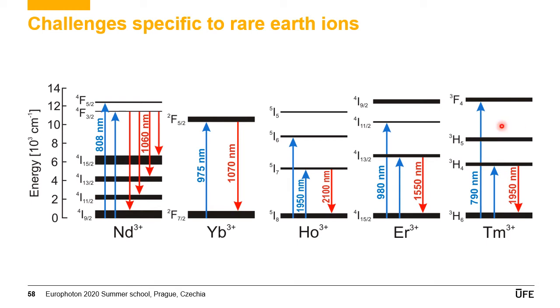Double-clad fibers doped with thulium are often pumped with photons with more than twice as high energy as the final laser radiation. So it seems to be very ineffective at first glance. However, with sufficient thulium concentration, one ion excited to this 3F4 level may share its energy with a neighbor. So the quantum efficiency is effectively doubled. This is the so-called 2-for-1 process.